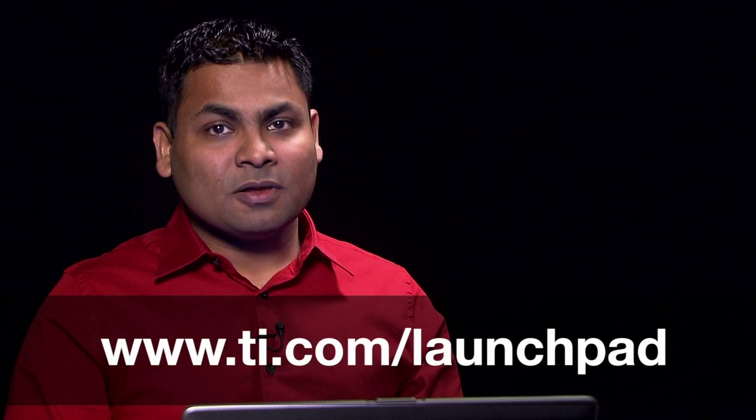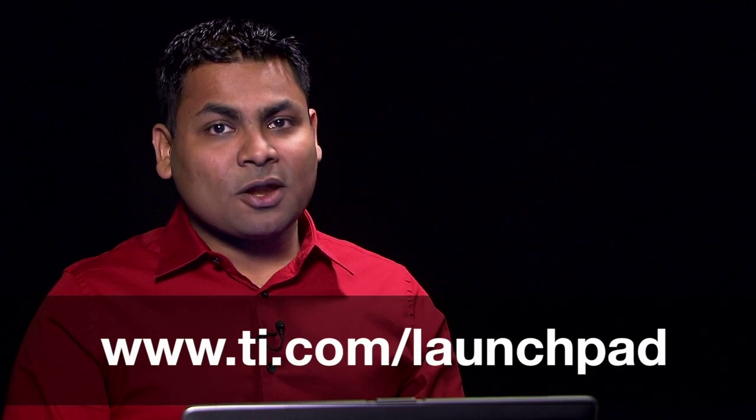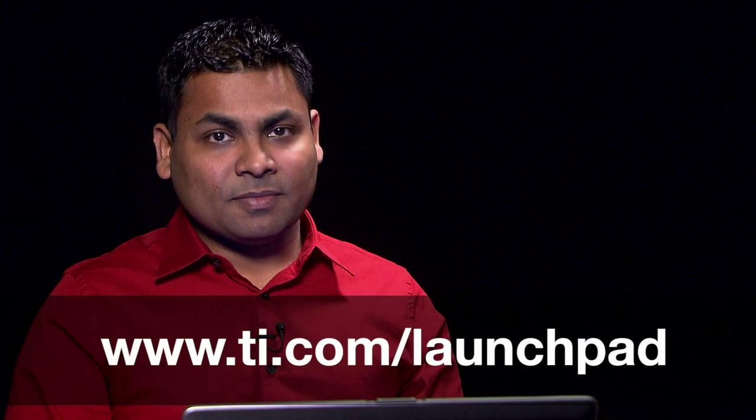Some great PC-based software is available for download from the Hercules Launchpad portal. Go to ti.com/launchpad and select the Hercules Launchpad tab. First, download and install the latest version of Code Composer Studio, or CCS — it's an integrated development environment. During the install, all drivers necessary to use the board and its integrated XDS100v2 JTAG emulator will be placed on the user's PC. It is important to make sure that the board is not plugged in until after the installation is complete. After the install is complete, the free license option should be selected. Since the launchpad has an XDS100v2 on it, there is a free CCS license to go along with it. This license is not time or code size limited. The next step is to download and install the Hercules Safety MCU demos that are available on the Hercules Launchpad wiki page.